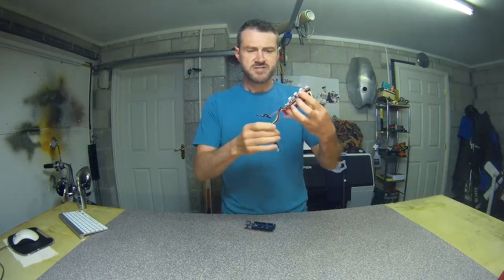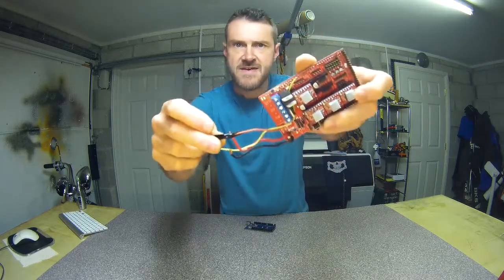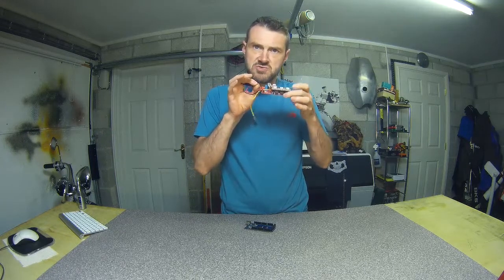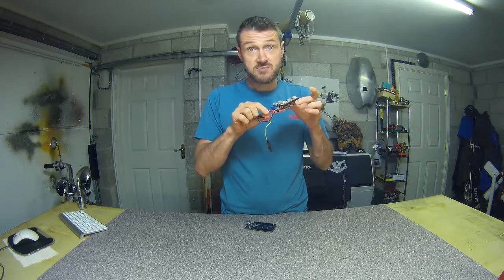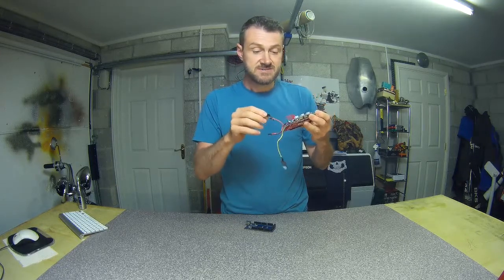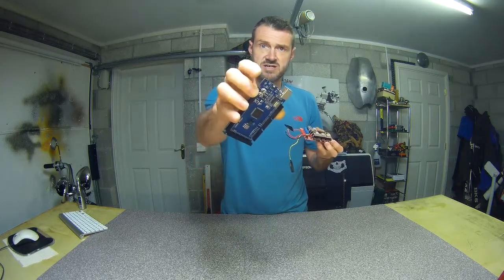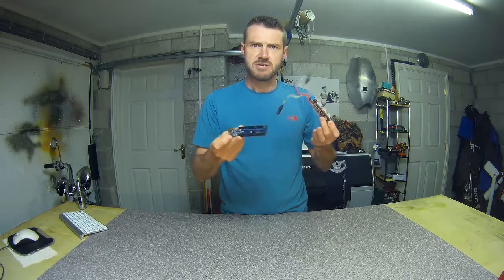The ramps is all done. I did add an extra wire — this little red wire — which is just providing a teeny-weeny amount of power to the second 12V input, which is purely powering that LED now, that's all it's doing. And the Arduino minus the DC jack, which we don't need because it just gets in the way of how I'm going to mount these.